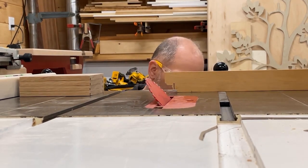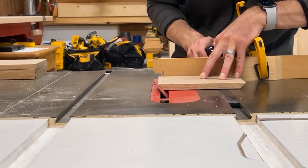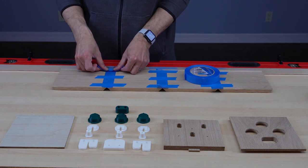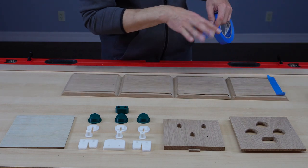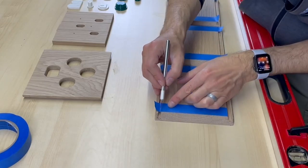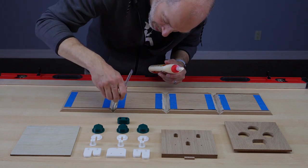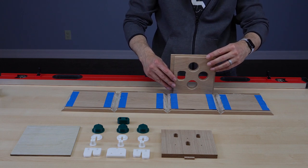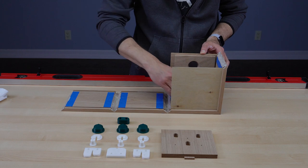After cutting the pieces to length at the miter saw, I tilted the table saw blade to 45 degrees and dialed in the exact location of a stop block to remove just the right amount of material and not further shrink the length of the sides. This helps me maintain the grain match at the corners. For small boxes like this with mitered corners, I found no better way to glue things up than by using the tape method. After lining up the pieces along a straight edge, I placed one long piece along the mitered edge to prevent glue from squeezing out, then stretched several pieces across the joint to put it in compression when the box is closed. I'm gluing all six sides of the box together at once, and then after the glue dries, I'll cut the lid free. Since I won't be able to access the inside of the box and wipe up any glue squeeze out, I took the time to add painter's tape to the inside faces as well. I used an X-Acto knife to trim the tape to size. I'd normally just have the top and bottom panels float in their grooves without any glue, but because I wanted the top to stay centered in the opening, I added a small amount of glue at the midpoint of the groove on two sides. This will hold the middle of the panel in place while still allowing it to grow and shrink over time with changes in humidity.